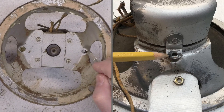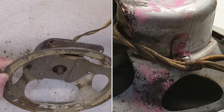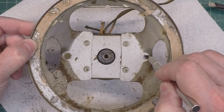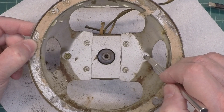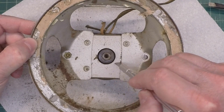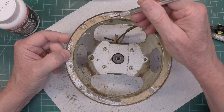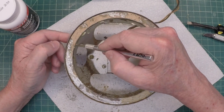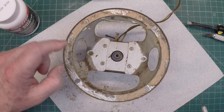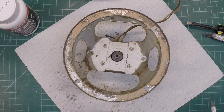You can see I removed this screw to be able to get the clamp that held the wires in place. What I'll end up doing is putting that back in — probably a longer fastener — get that snugged down, and at the same time use some shims around this center pole piece. You can see where I did the cutting, and the speaker itself was actually just free from the frame.